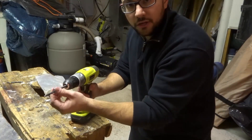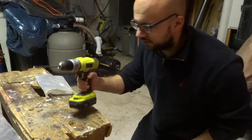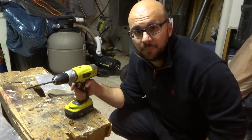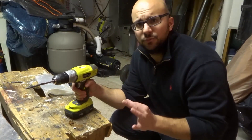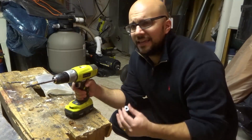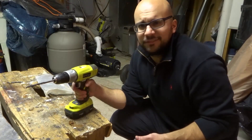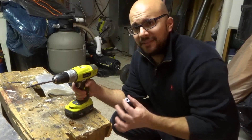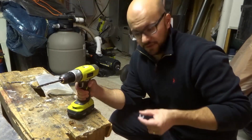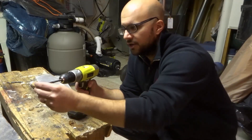That means that without the washer, if I was actually drilling a hole in this tool bench, I would be drilling downwards or upwards — which 99% of the time is not what you want to do. There are times when you have to drill on a decline or incline, but most of the time you just want to drill level, especially if you're doing anything with finishing, wall anchors, hanging pictures, anything like that. When you really need to make sure it's absolutely level, that's when you use that washer.